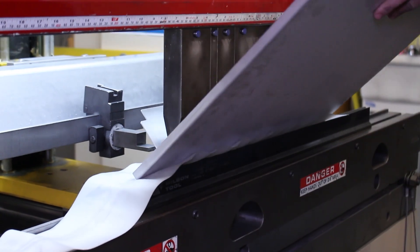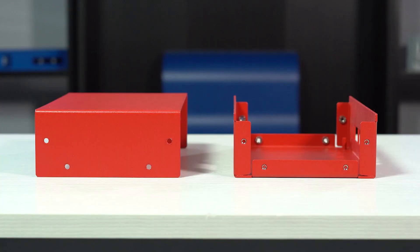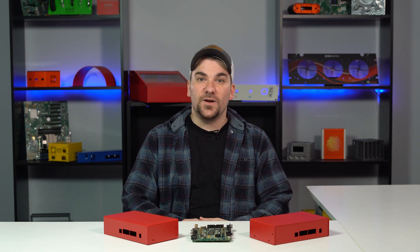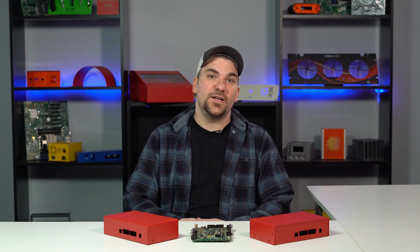U-shape enclosures, also sometimes referred to as clamshell enclosures, are one of the simplest types of enclosures to design and manufacture. They are made by bending two pieces of sheet metal to form the shape of a U. The enclosure is assembled by dropping one piece onto the other and secured using the fasteners of your choice. Because of U-shape's ease of manufacturing, they are suggested whenever possible to keep costs down. They can also solve a number of design challenges in their unmodified form, or they can easily be modified as required.